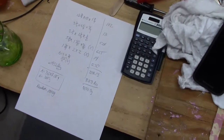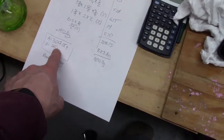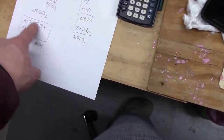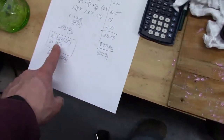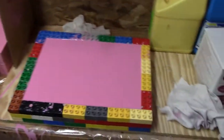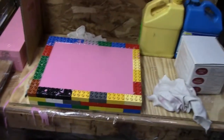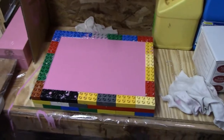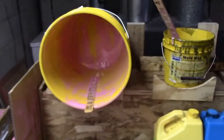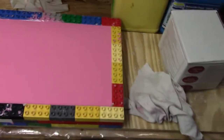So we tailored up the volumes and the weights and came up with the equivalent grammage. This is the final grams we came up with. I probably should have put a little bit more because I ran short trying to fill up all these old molds. Usually you throw like a one to two percent error on it, and you can see the two percent stuck in there. The top part of the mold is done.